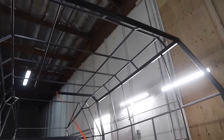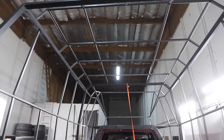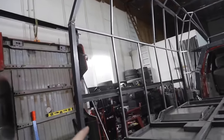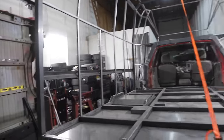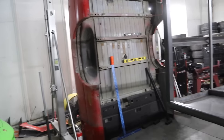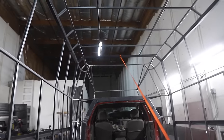We got the roof completed — looking good. There will be more supports coming in the front and in the roof, but that's just to support the sheet metal so it doesn't wobble going down the road, so that'll be angle iron rather than full square bar just to save weight. We did some calculations: each foot of one-inch square bar weighs a known amount, and all the one-inch we've used so far on this build comes to 460 pounds — really not as much as it probably looks. We removed a very heavy rear truck bed that's probably about 400 pounds, so we're probably plus 400 to 500 pounds right now — we're in good shape. We just received the final shipment of parts for the front-end conversion to the 2020 version, so we're going to get started on that in the next episode. Make sure to stay tuned and subscribe so you don't miss it — we'll see you on the next one.